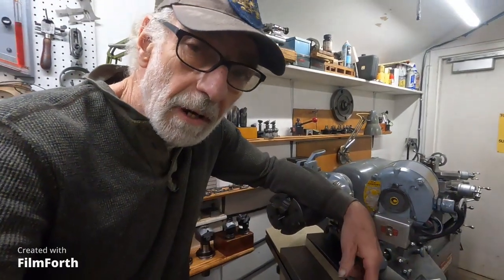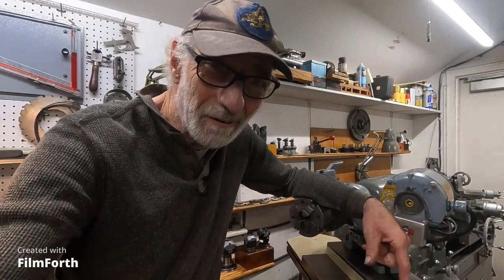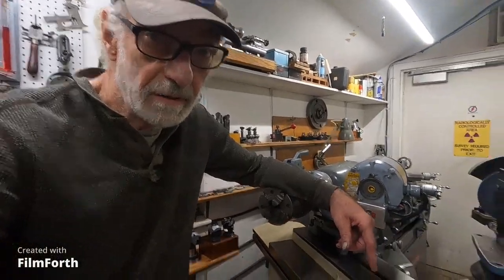And one of the guys who's been into this a long time mentioned to me, he says, if you think about a Cincinnati tool and cutter grinder, find a good workhead, then the grinder. There's no sense buying a grinder if you can't find the accessories. And the accessories seem to disappear and go for high prices. And then there's the problem of getting a bad workhead. And I've been through like 3 of them to get this one.